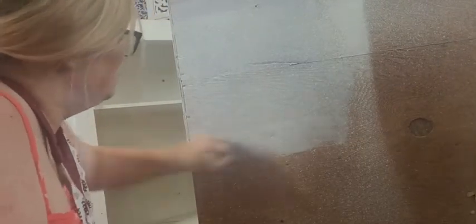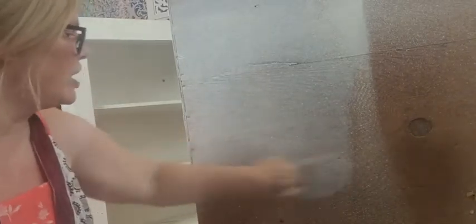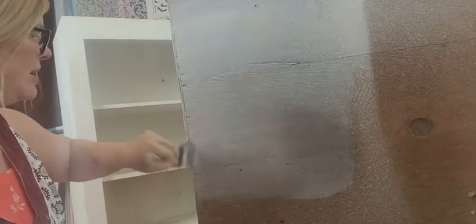BOSS does come in white and in gray as well. If I was going to paint this white, I would probably use the white or the gray just to have a jump start on the primer. The smell — that old basement smell of a 1940s house — is already lessening just by me putting this on and it drying, because it blocks the odor. I cleaned these first, the smell was still there, old basement smell. And now I'm going to stop that.